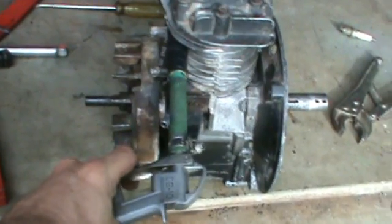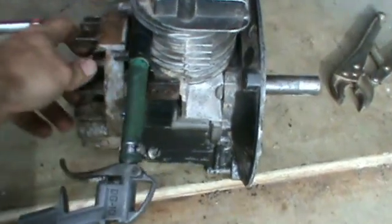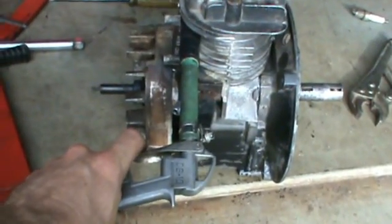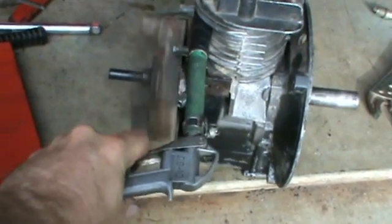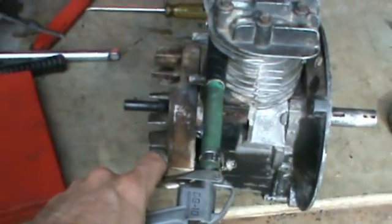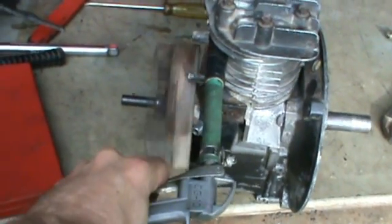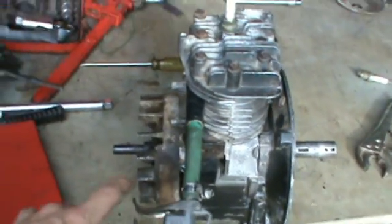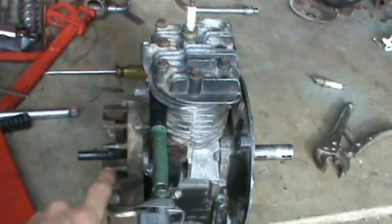It really needs low pressure and a two-cylinder setup with a heavier flywheel to keep it going. But on the power strokes there's heaps of torque - you can't hang on to the crankshaft at all. There we have it - a basic steam engine.